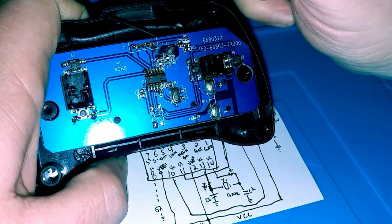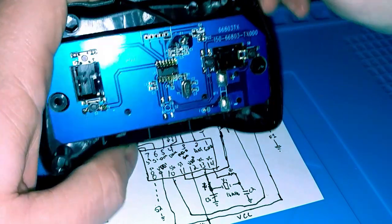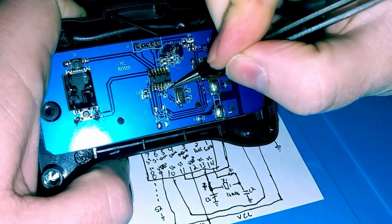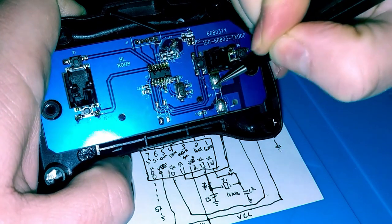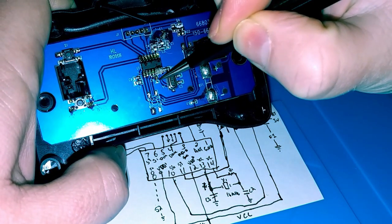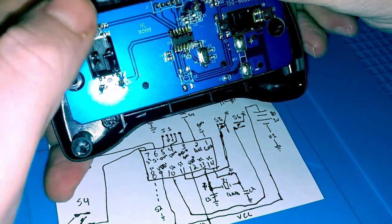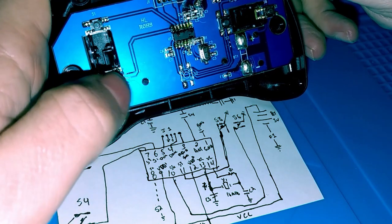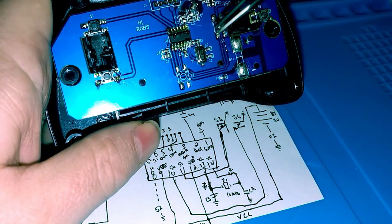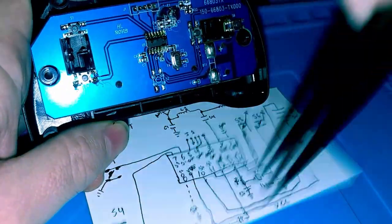I think what occurs, so before I start talking about that more, remember, the remote control transmits a 2.4 gigahertz signal out. All right, so you got the 3 volts coming into pin 9 and pin 12, like I said. And then you have your switches, S1, S4, S3, S6. S2 is not populated. Your switches are each tied to a pin on here.